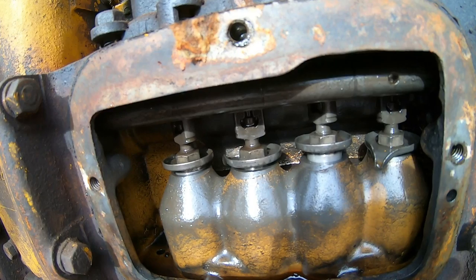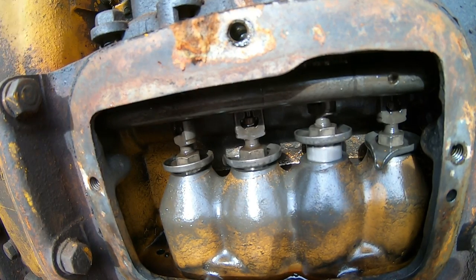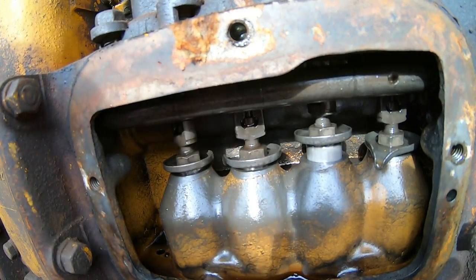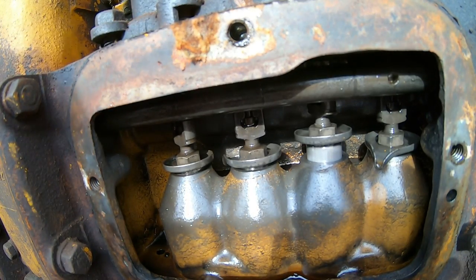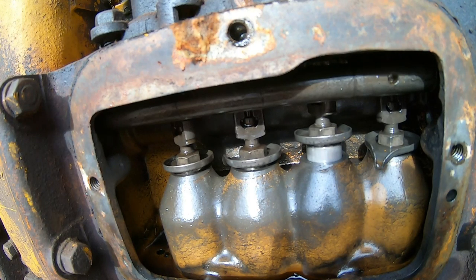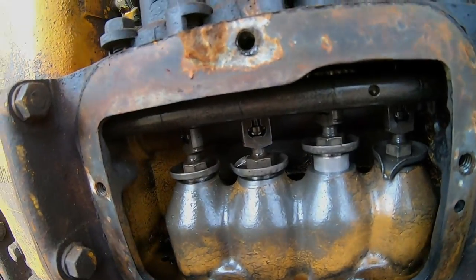But all right. Our rack is not stuck, so if any one of those would have went up and stayed there, well, that means that it also can't twist. And when the rack opens and closes, that rack bar is going to move them back and forth and twist those plungers. But all that stuff's looking good, so we'll put the side cover back on.